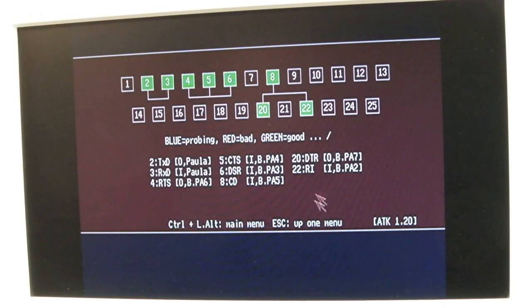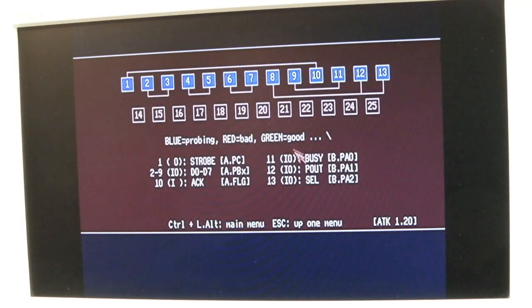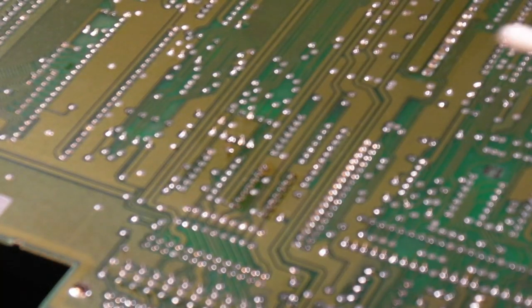Powered on and booted from floppy - let's test the serial port straight away. That's looking better - serial port perfect! Let's test the filter audio. One, two - the filter is working, yep! And let's now just test the parallel ports again. I'd be very surprised if the parallel ports now mysteriously work... oh my god, they do! Isn't that interesting? The 1488 doesn't seem to have anything to do with the parallel port, and yet there we go - that was a simple one.